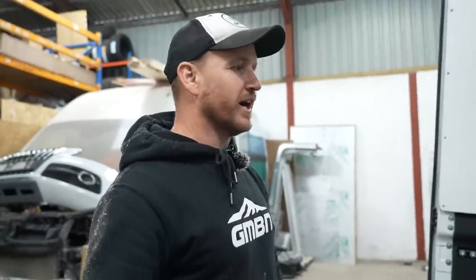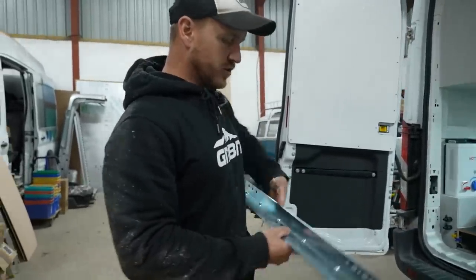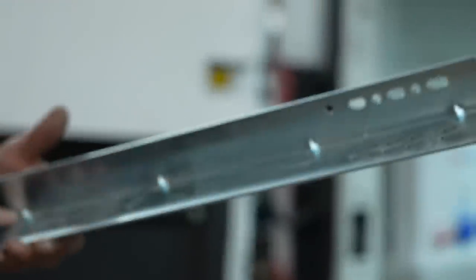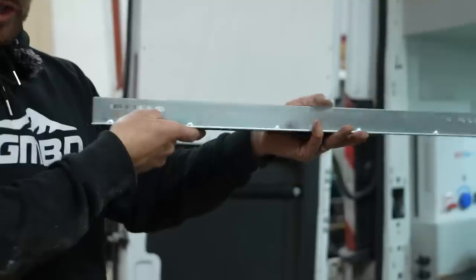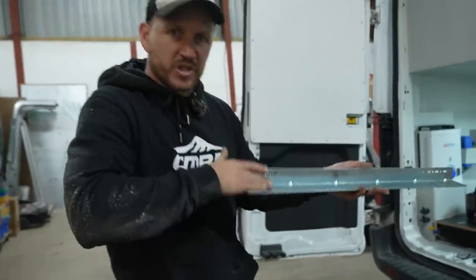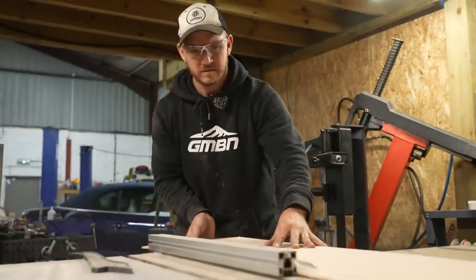It just feels a bit tight. The drawer's really hard to get in and out. It slides really badly. And where I've screwed it, it's trying to push it down, but because it's got these ridges here to make it a lot stronger so it doesn't just bend down, that's why they do that. It goes on there and then pushes away, like a little ramp. So I'm gonna put some spacers under there and that should sit quite flush.